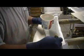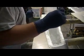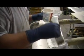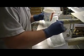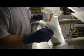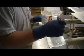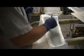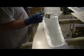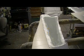Just gonna let that soak in, then we'll go back and scrape some more of it off. We've got a couple minutes — keep the glass from floating. Remember that: if we got too much resin, that glass will float and we don't want that. We want this stuff to sit flat with no lumps, so we need to scrape off the extra resin — but make sure all your cloth is saturated before you do that or you'll end up with dry spots.